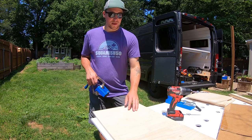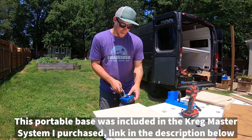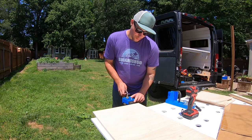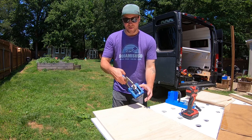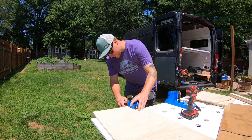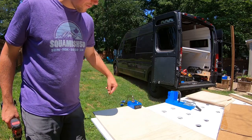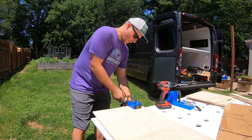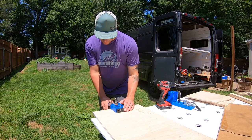We finished with the side pieces, so now let's get onto the bottom of the cabinet. Because this one's so big, I didn't want to use the Kreg base jig, so I have this one that connects onto the pieces of wood. It has a 90 degree angle which you just slide up to the board. You line up the pocket hole with where you want it on the side of the board, and then this clamp has connector pieces so you can easily pop it on and off. I square it up to the side, lock in the clamp, and then fire the micro bit in. Move your clamp and you've got your pocket hole — you can just go on to the next hole.